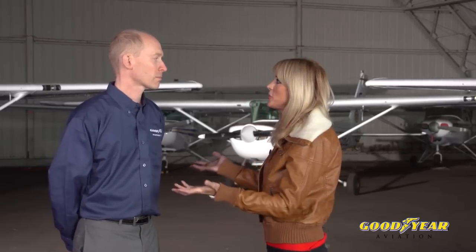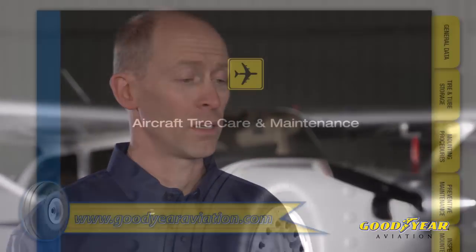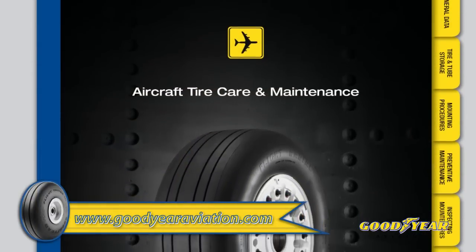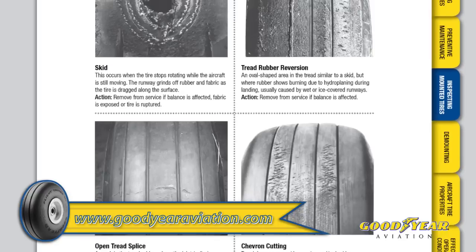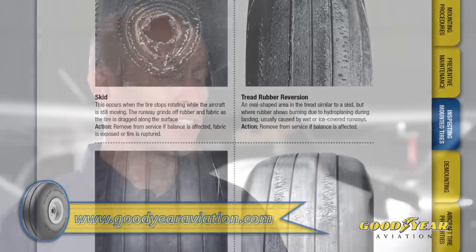So can you swap out the tires to even out the wear? Certainly. It's similar to rotating tires on a car, except you have to dismount the tires and remount them facing the opposite direction on the wheel. Okay, so what else should we be looking for? Anything that might make the tire unsafe. Goodyear's aircraft tire care and maintenance manual has a whole section with pictures on different conditions and the removal criteria for each. But as a general rule, you want to remove any tire with any damage where you can see the cords down at the bottom of the damage.